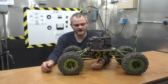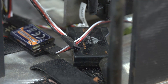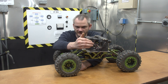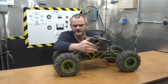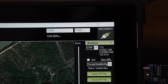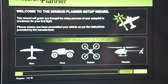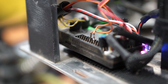We also have our telemetry. For the computer nerds out there, this is essentially an asynchronous serial transceiver — it's a wireless RS-232 port. Whenever you connect the receiver into your computer, it's actually going to register as a COM port, so it is literally a straight-through serial connection. It typically runs at 57,600 baud. From there you can connect and do everything including program the APM through the serial connection. You can download the rover firmware wirelessly or through the USB connection, which is essentially a USB-to-serial converter.